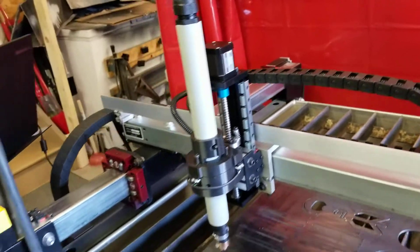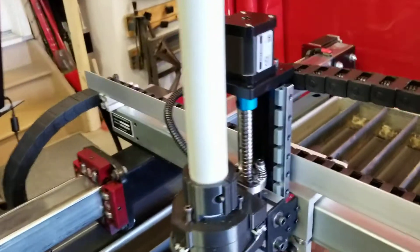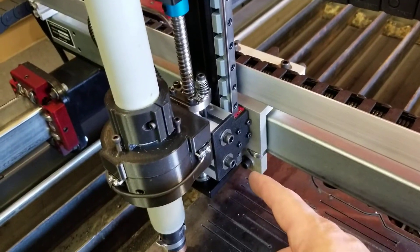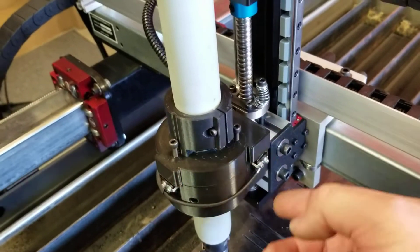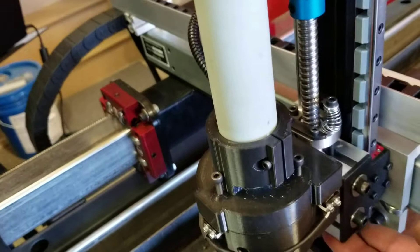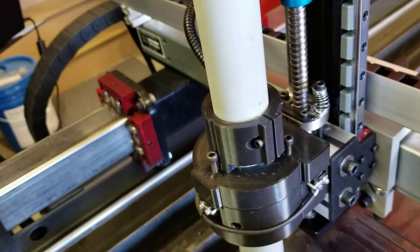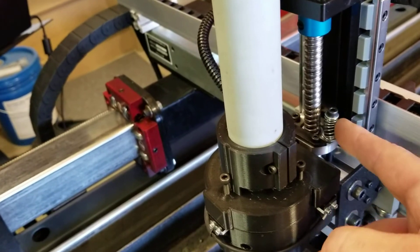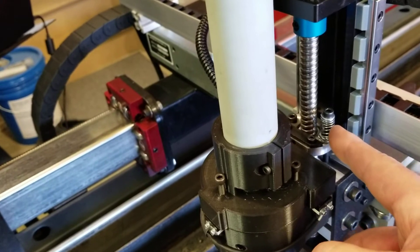Here's what I've been doing on the Crossfire for upgrades. I've got this new linear slide z-axis here with very smooth linear bearings. This is the floating z-axis. It's about 400 grams to activate it on a scale. I can put a stronger spring in here, I just haven't been able to find one that will work yet, so I need to order some more springs.